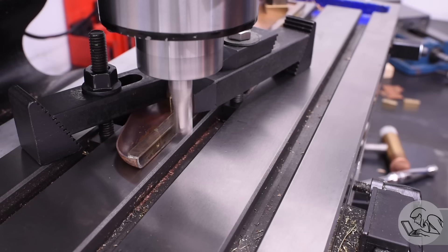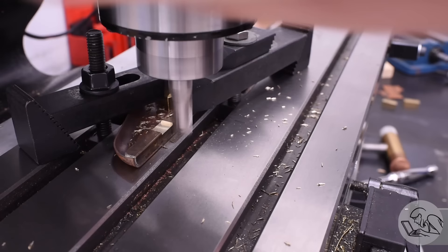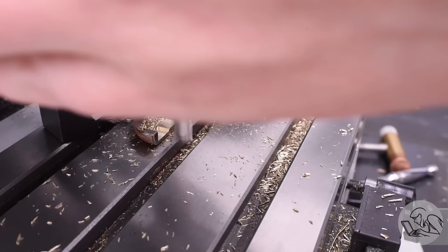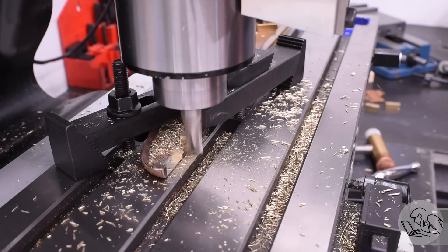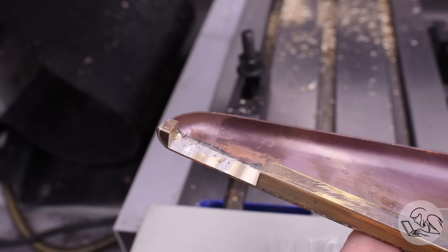On to step beta of plan orange, which is to mill away this piece of the sill bar at the front so it will be clear of the area that needs to be hammer formed. This has to be done very carefully — I want to mill away just the brass of the sill bar without touching the copper at the bottom. I'm also taking fairly light cuts because the fixture here is not super rigid; a lot is depending on the strength of that copper sheet to hold this sill bar in place against the milling forces. When I'm close to the bottom, I start going very slowly — like one thou and half thou passes — until I get down to just where you can see the solder layer between the brass and the copper showing, and a little bit of the copper showing below that. That's where I stopped. I don't want to get into the copper at all — this copper is pretty thin. That was slightly nerve-wracking, but it seems to have gone well. I've got just the solder layer and a few wisps of the brass sitting on top of the copper.